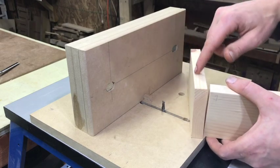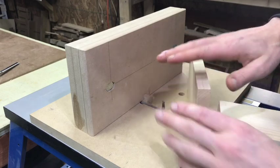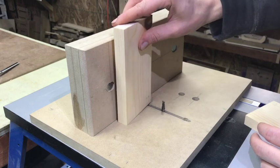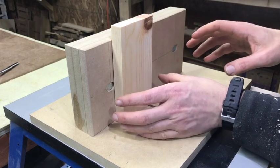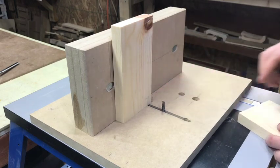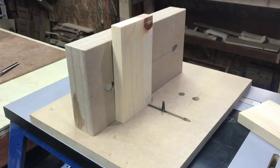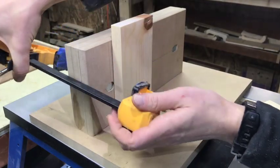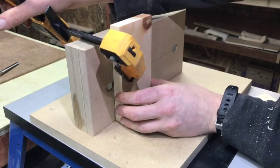and we want to make sure our pin, decide on your box which side you want being the over. So there's going to be an over and an under. So decide ahead of time which one you want, and that will be the one we cut first. And we're going to line it up, push it into our pin, but don't yank it over there. You don't want to bend this. You want it just setting firmly against the pin. And then we're going to clamp this down firmly against the pin, but not smashed over there.